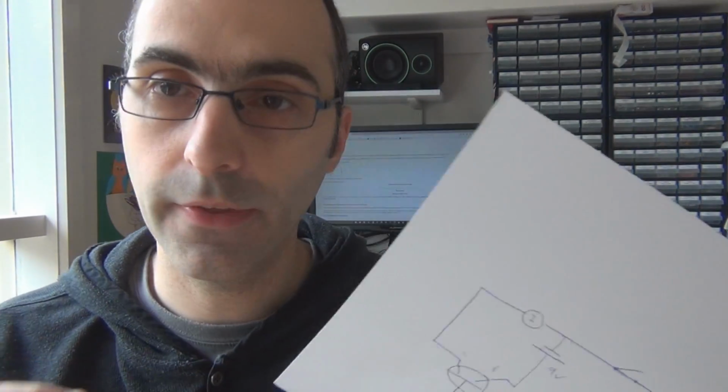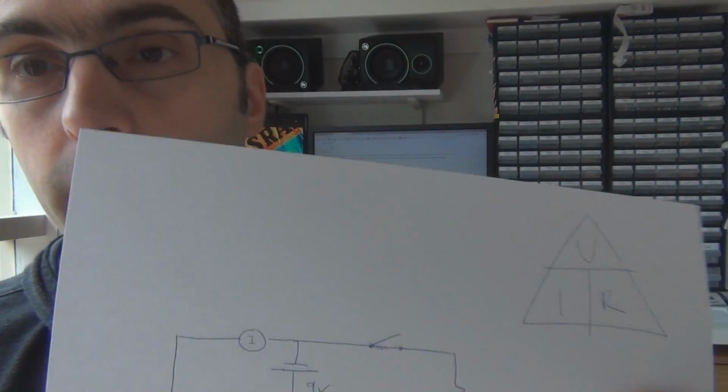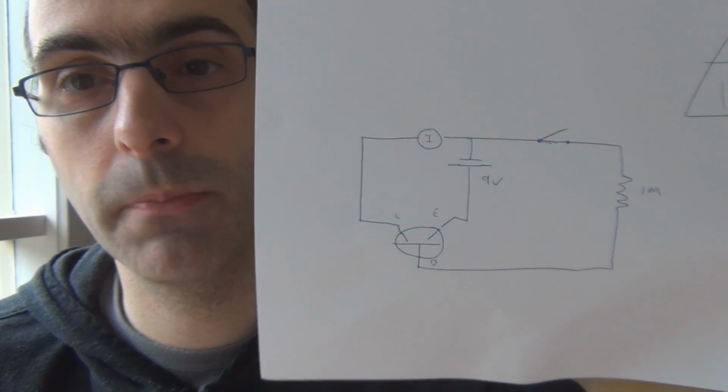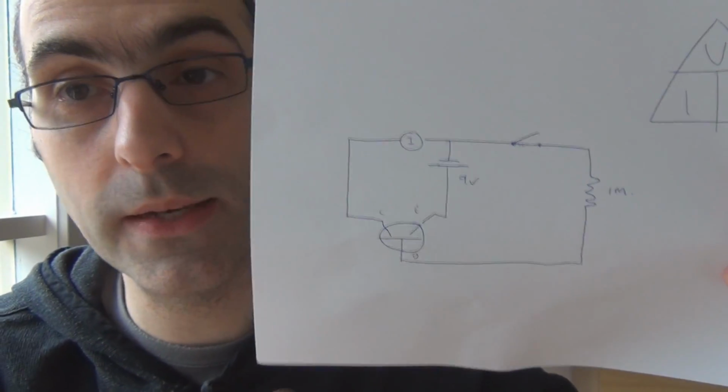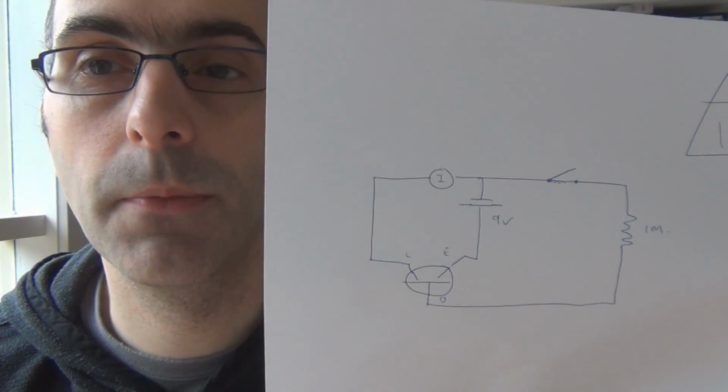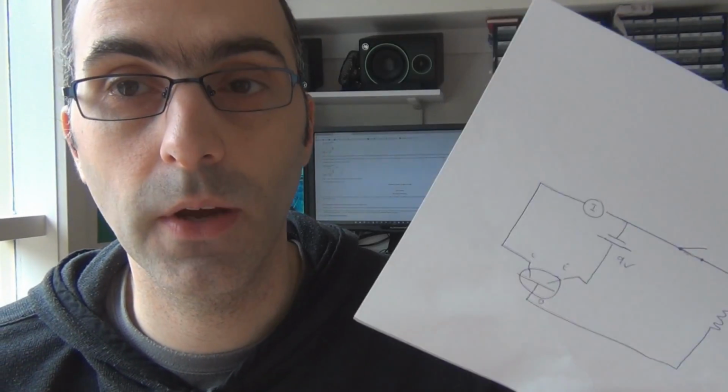So that's nice and simple, and it works well. As I've said, it will give you an accurate reading. The thing is, though, with germanium transistors, they change. If you get the same transistor and put one microamp on the base, you might find there's 20 microamps on the collector. So that's a different reading. It's not 10 anymore, now it's 20.